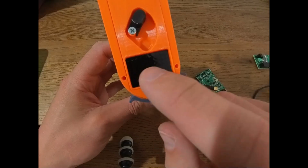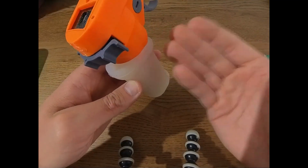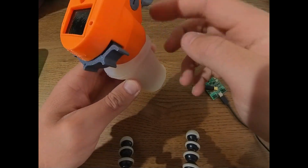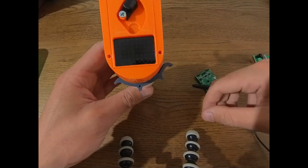After that, it's going to show us EC, which means error in calibration. And then after that, off, which means hands off, don't touch anything. After that, an arrow flashing to the bottom, which means give it full throttle. And then after that, arrows to the left and the right, where we need to press left and right.